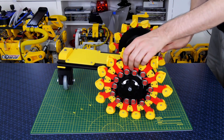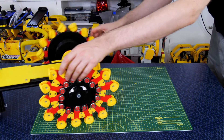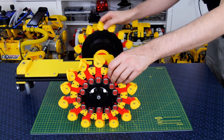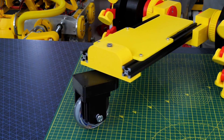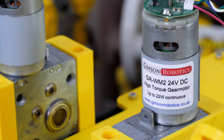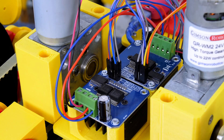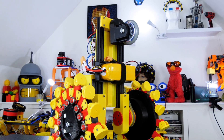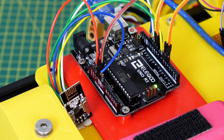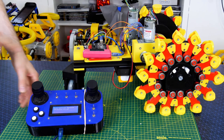Each of my pedrail wheel assemblies is attached to a piece of 2020 extrusion and there are some plastic parts in the middle that hold the lot together and give me a platform to attach electronics. I've made a caster wheel out of an inline skate wheel. I'm using two 24-volt worm gear driven gearboxes and motors, each one with a belt drive onto each of the wheels. I'm using two BTS7960 motor drivers with a 24-volt LiPo strapped to the bottom. The main electronics is an Arduino Uno with an NRF24L01 chip for the radio, and as usual I'm using my Opendog 2 remote that I use for most robots.